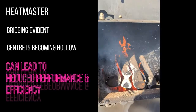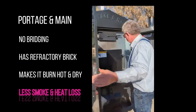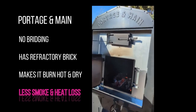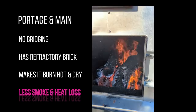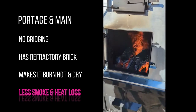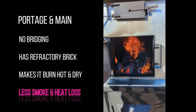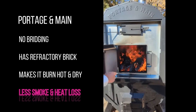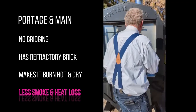There's our wood in the firebox - you can see there's no bridging happening, it's going down nice and evenly. Sometimes people are pretty amazed at what the bricks are doing: it doesn't smoke so bad. You can see there's not a lot of smoke coming out - matter of fact, there is no smoke coming out the door, probably just some vapors. Before we put the refractory brick in that stove, if you were to open that door there would be a lot of smoke coming out. The refractory brick is making it burn cleaner and drier.